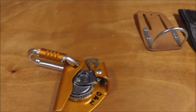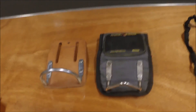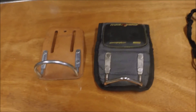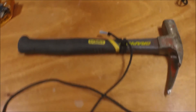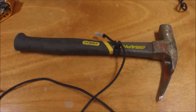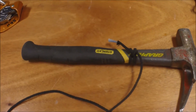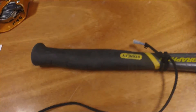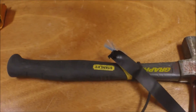Also, we need to talk about proper tools. Hammer holder — very important. You shouldn't be walking around with a hammer in your pocket or in your belt. A hammer holder is good because it will prevent the hammer from falling out and dropping on people. If you're climbing with your hammer, as in doing scaffolding, you should always have a tie line or tether hooked to it. A tie line is nice, but when you tie the knot it may not be good enough — you should always secure with a piece of tape so it won't fall off.